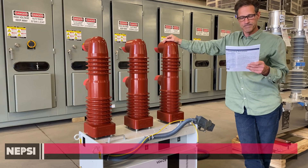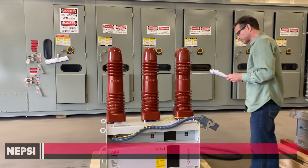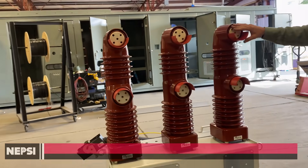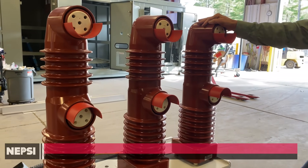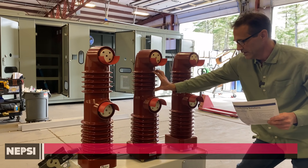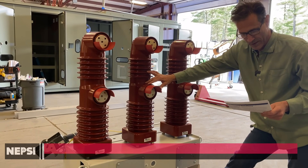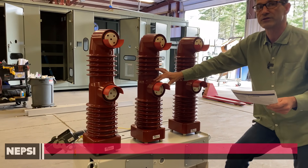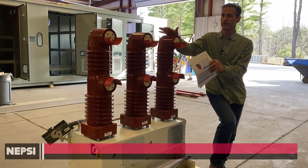Other features include watchdog contacts for the internal CPU, and 4A and 4B contacts. Incoming and outgoing terminals are on the back side, and it does not matter which terminal you connect to. The vacuum bottle is located within this area. It uses a voltage sensor to sense Phase A voltage for synchronous closing via servo motors, with special contacts in the pole area for capacitor switching. The servo motors allow very precise closing of the vacuum switch, preventing pre-strike and re-strike on opening. If you have a lead time issue, we stock these vacuum switches at our factory in Queensbury, New York, and ABB has committed to short lead times as well.